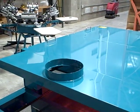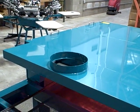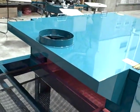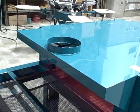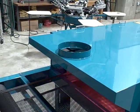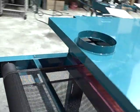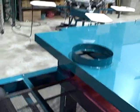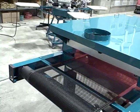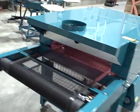Most people don't put their vents at the end of the dryer like this — they put them in the middle. By putting the vent on the end, as shirts come out of the conveyor dryer with a little moisture and smoke, we're able to capture that and get it out of your shop. Another big benefit is that by exhausting here we're able to cool the shirts as they come out, so they can fall into your catch box without being hot and having the ink stick together. This unique end-venting method is exclusive to Workhorse.